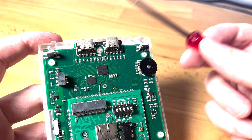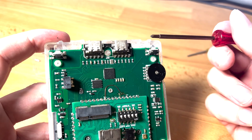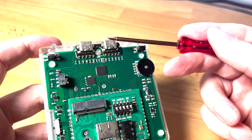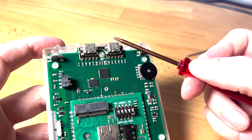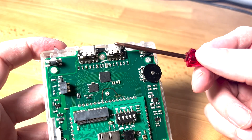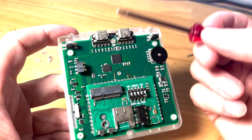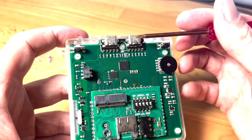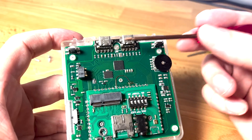I believe it's fast enough for USB 2.0, and since it's software you can do whatever profile you want — so that's available. I haven't done anything with it yet, but that's pretty cool. It's got charging and power on both of these — both are just connected to five volts. So it's not actually detecting; theoretically in order to output five volts, these should have circuitry to detect whether or not, as USB-C, it's a downstream device. So there's a problem if you've got a device connected — you could be injecting five volts somewhere it's not supposed to be.